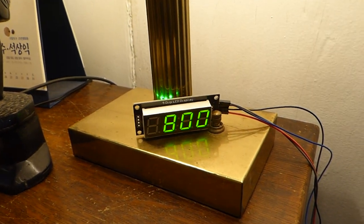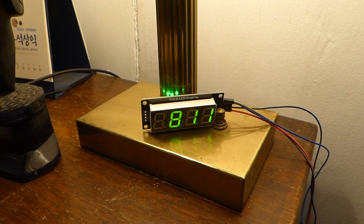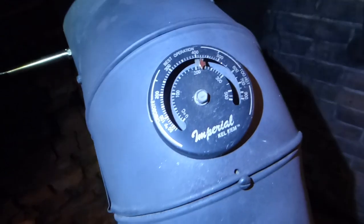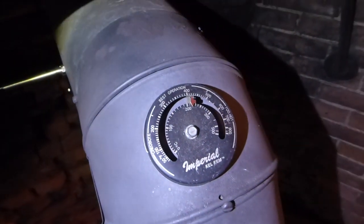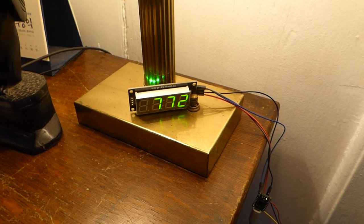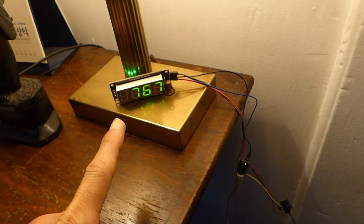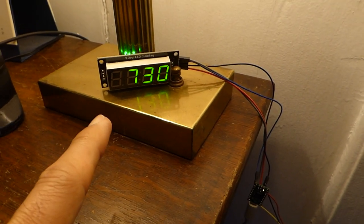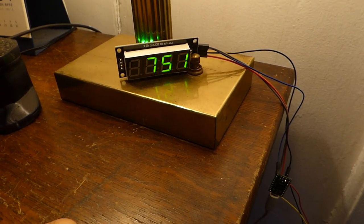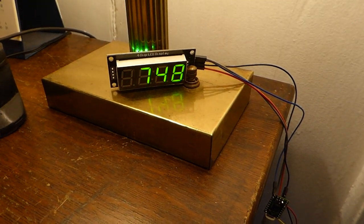It's just starting to get past 800. The stove pipe thermometer is showing 410, maybe 415, and will probably jump up to 450 at some point. So now I'll start closing down the vents. The range I'm going for on the digital is different from what's on the stove pipe thermometer — you just have to calibrate the desired range here with what you actually see on your stove pipe thermometer, and that'll help you keep your fire going exactly where you want it.